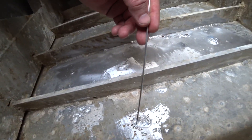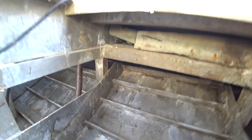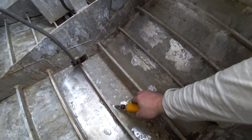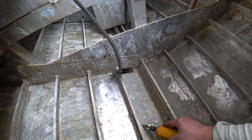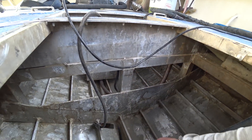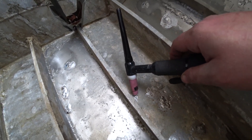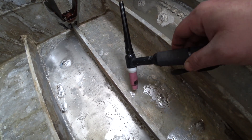We've done up here along there, filled in the rest of that, filled in over this one. Those ones have been filled in previously. Filled in a little low spot there. I think the rest of the section just really needs a bit of a clean up with the Dremel. If I find a spot like this little pit, I get in and take out the corrosion, then come along with the TIG head, build up a weld pool, add material and come forward over the top of it to fill it all in.